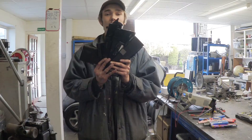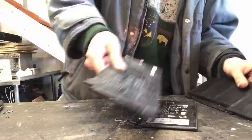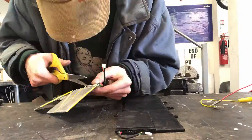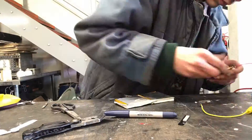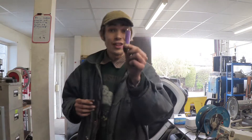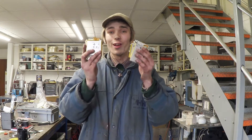Let's take these apart and test these as well. In total we managed to get 50 18650s out of these laptop battery packs, and out of that, 24 actually work — which is just under 50%, which is awesome. The dead batteries I'll take to a local recycling place, which is actually at my local supermarket. In total I managed to pull 33 flat cells out of the battery packs, and out of the 33, 16 are alive and working. So now let's build our 18650 battery pack.